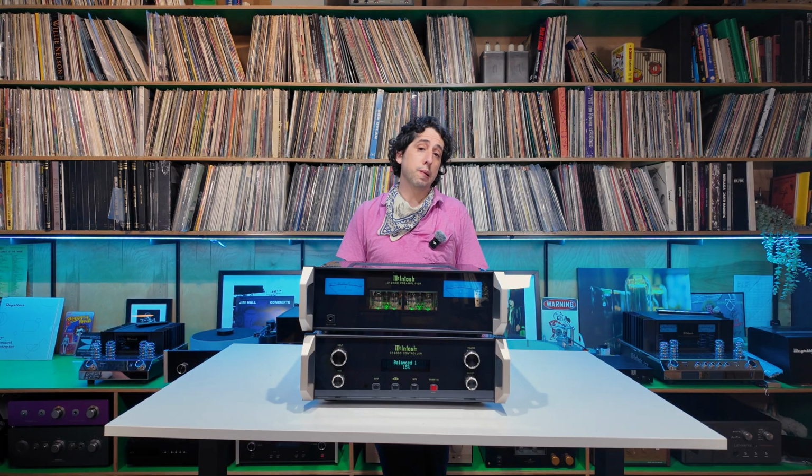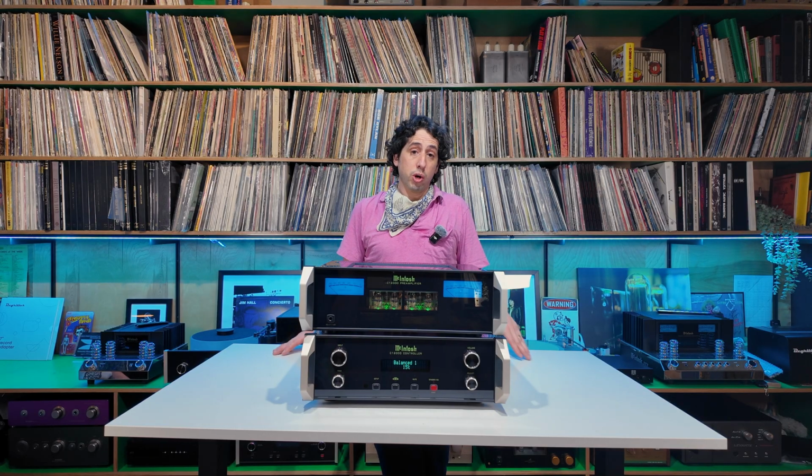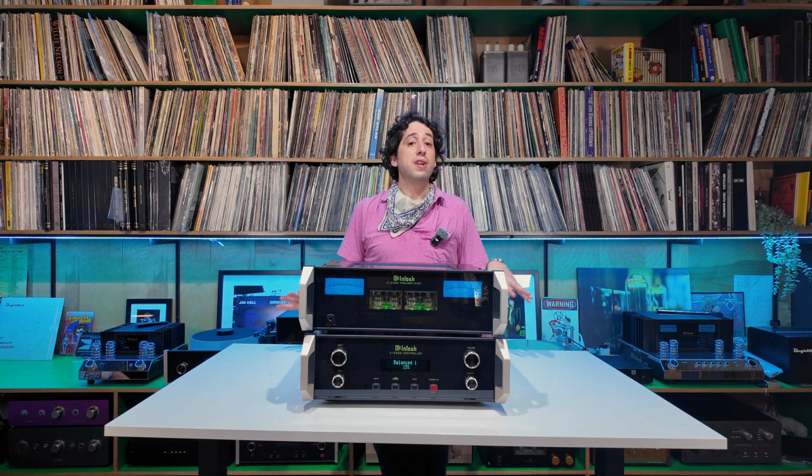Additionally, putting the power supply in a separate box also keeps electromagnetic noise and any type of electronic interference of the high voltage circuits away from the delicate audio circuits in the top box. Also, because it's in a separate box, it allows the power supplies to be robust, meaning big. And if there's anything that you should know about hi-fi, it is that power supplies in any piece of equipment are amongst the, if not the most important aspect of the design of a hi-fi component.